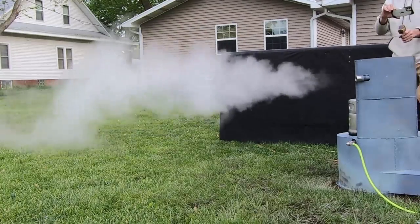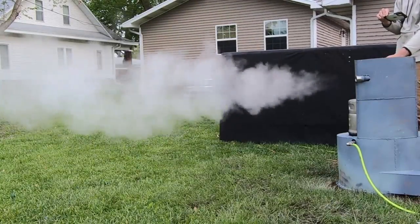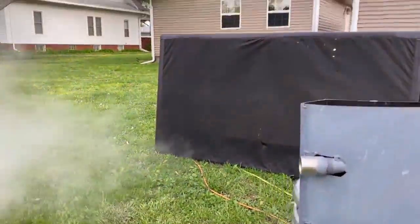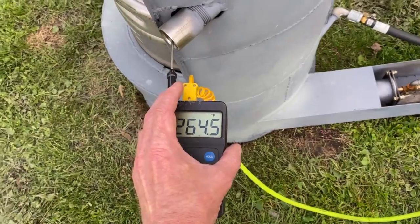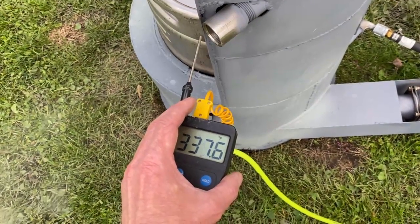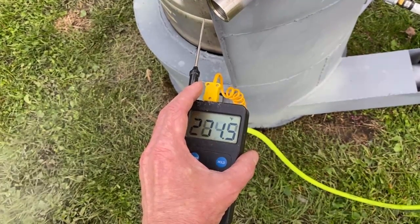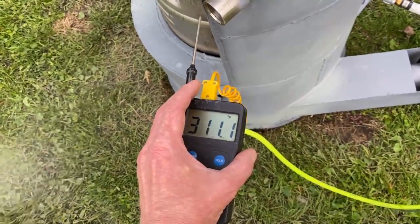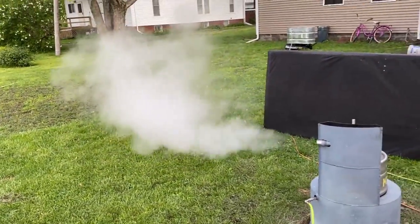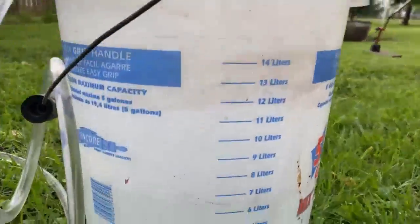The reason I added the air blower augmentation was because I knew we would get a lot more power out of the machine by mixing steam with hot air — this would improve the effectiveness. Hot air can kill weeds just as well as steam, so I felt like we'd get a lot more power out of this device. We're really screaming hot now. A regular boiler can't do this without a super heater on it, even though we're running at atmospheric pressure — this is not a pressurized boiler. The heat exchanger is the perfect size; I got lucky there, going off past experience.